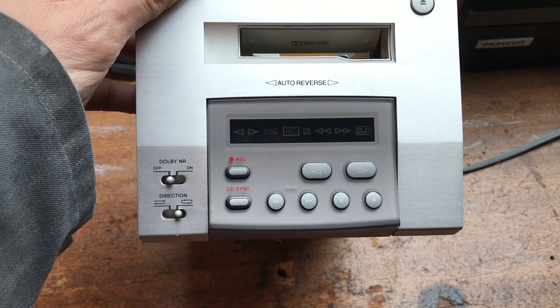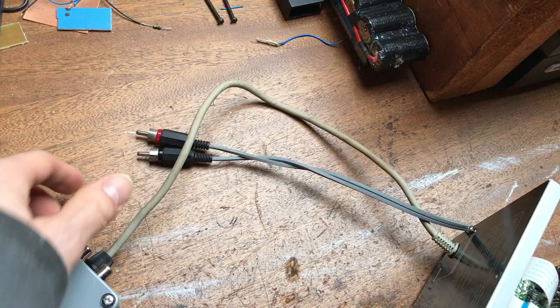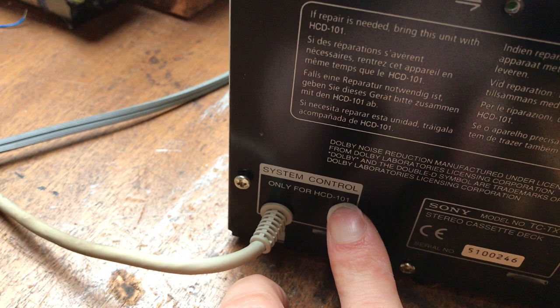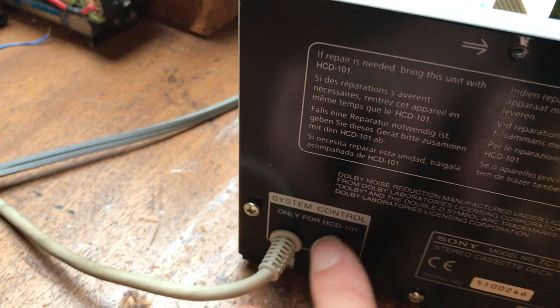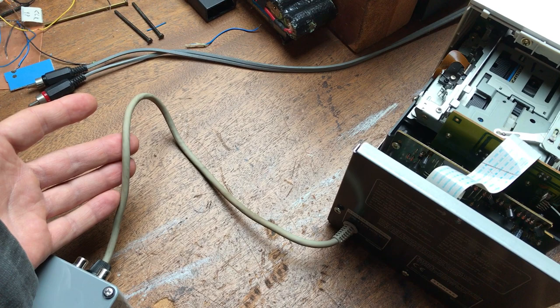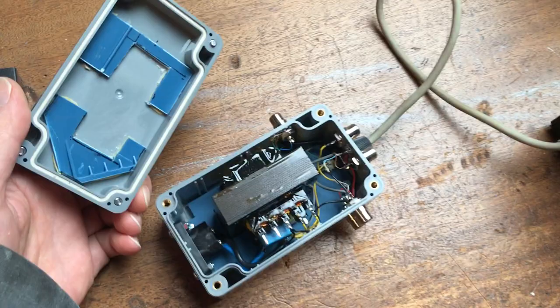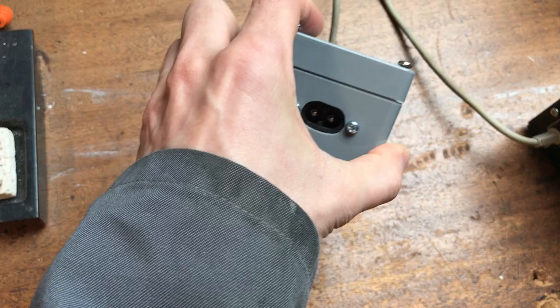It originally has a wire with a 9-pin mini-DIN plug and only connects to the HCD-101, which is the CD player/tuner/amplifier — which I don't have. Looking at the service manual, the supply is two and a half volt AC, so I made a little transformer here with a center tap giving two times two-and-a-half and two times seven-and-a-half volts, as it should be.